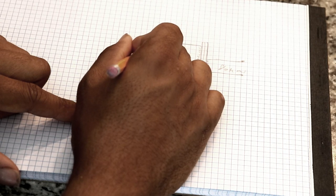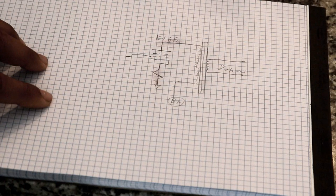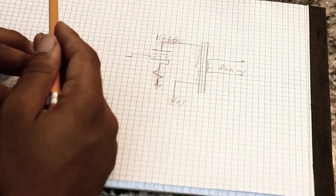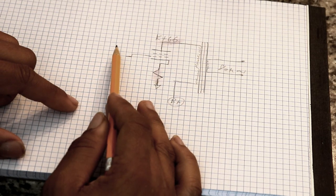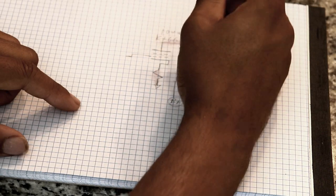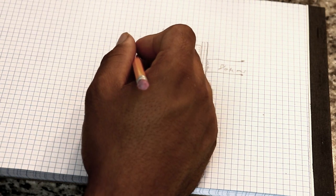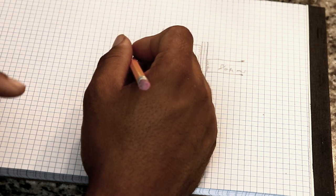So that's the simplest form of what our output is going to look like. Now, working backwards — I'm unsure about what I want the front of the amp to look like, where to put the tone control, volume control, and gain control. But I can figure out the output because we have solid parameters for that. Working backwards from the output, I also know I need something to drive this KT66. The preamp section is what's going to drive that tube, so I need a driver — and one of those drivers is going to be at least one triode of the 6SN7.